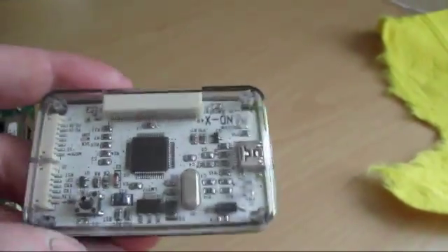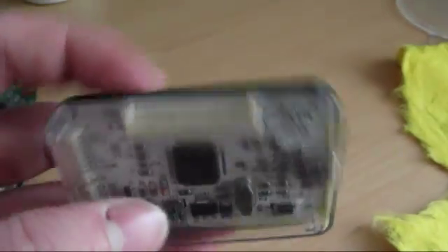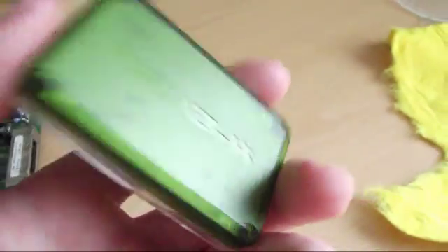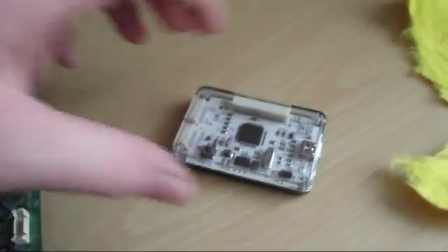You're going to need a NANDx or a JR Programmer. Using the NANDx, these can read the NAND fast — it's a nice little piece of equipment. It reads the NAND very quickly, about two to three minutes, and it writes the NAND within two to three minutes as well, which is a great thing.